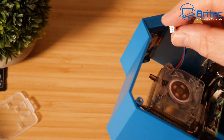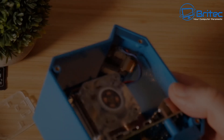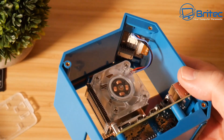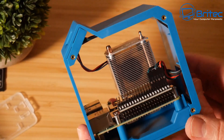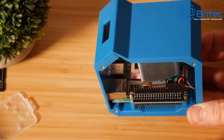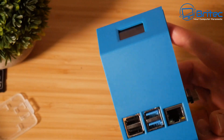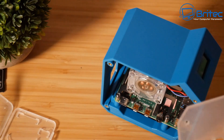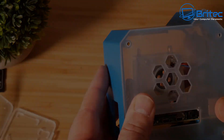This is the fan connector — this goes up to the top here. This was a really fiddly job if you've got big hands, but I managed to get it in there. A pair of tweezers or long forceps might be useful to push that in. That's now done. All we need to do now is push in the connector for the OLED display onto the GPIO connectors — that can go inside, not on the outside, and that frees up a load of pins on the outside if you need them. We now have a finished result. We just need to put the side panels on — I think this looks absolutely awesome. I just need to pull off the inside perspex cover so when we screw it down the protective coating will already be removed.